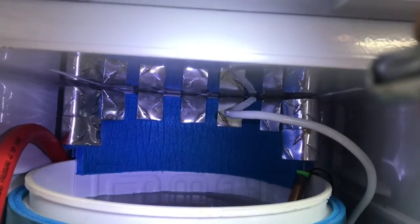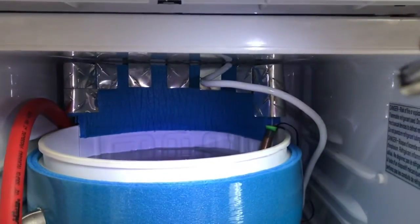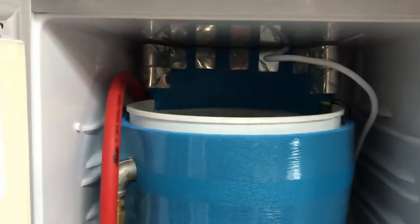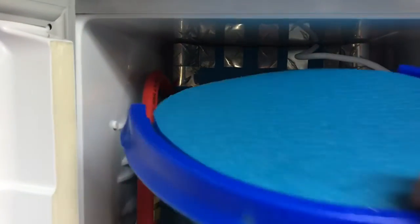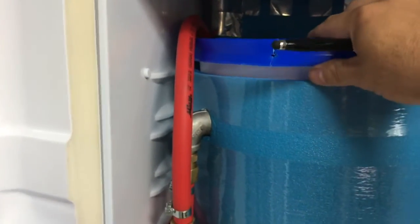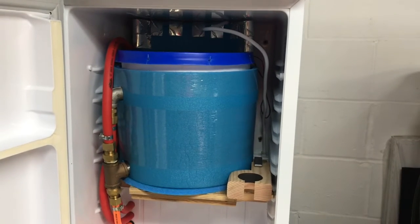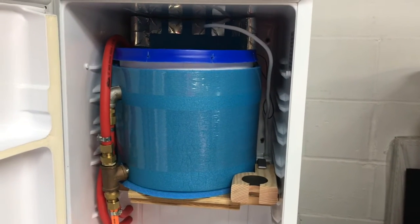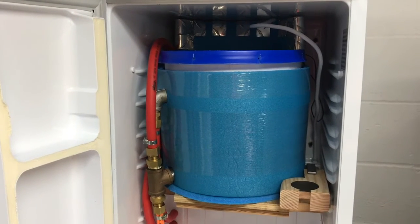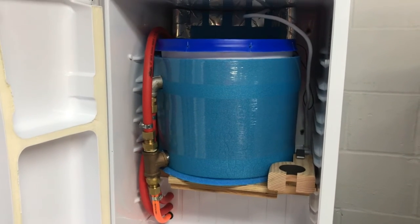The plate is a little taller than my bucket, so I've got the top of it covered with foam that I put on it and bent up some little aluminum clips. This thing is super efficient, and like I said it's always on. If I go to run my blowgun just to blow something off quickly, the air goes through this refrigerator — it dries the air constantly. No maintenance, no turning it on and off with my compressor. I'm real happy with it — you guys have any questions, let me know.